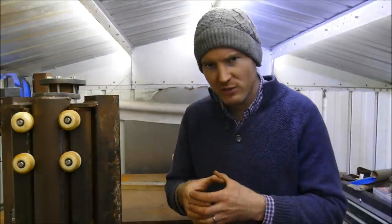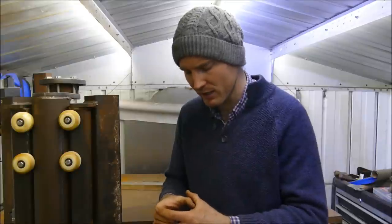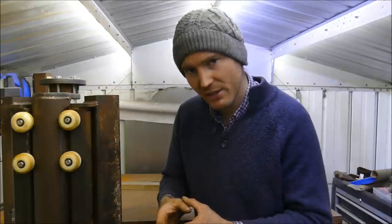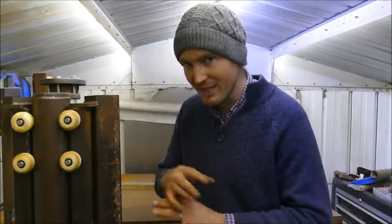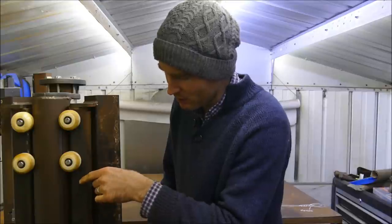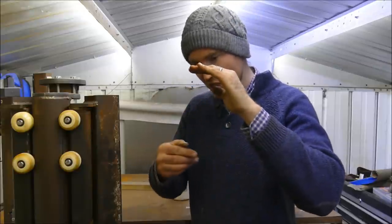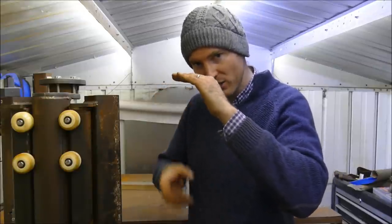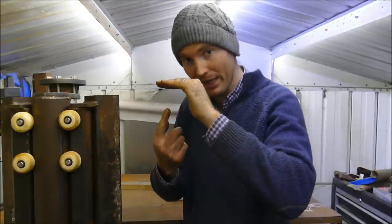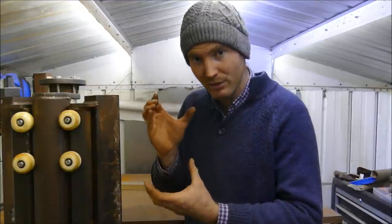But what I also need to explain is that the previous cylinder cushions that I was making for you guys, I'd like to stop making those if I could, because I believe this new system means that you don't need it anymore. Because of where the sensor is placed, the head of the hammer never gets to full extension. Instead, it switches, creating a pocket of trapped air at the very top that increases with pressure as the hammerhead goes up, acting like a spring, sending the hammerhead back down the other way. It means that your cylinder is now fully protected.